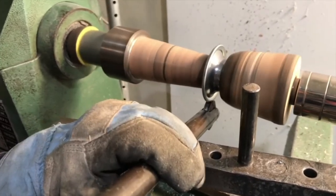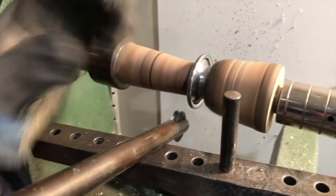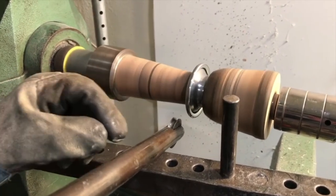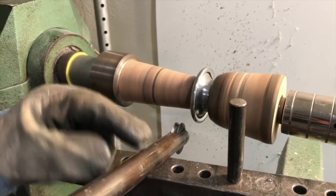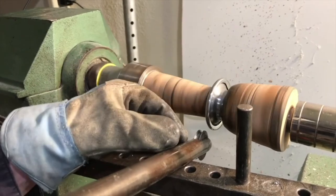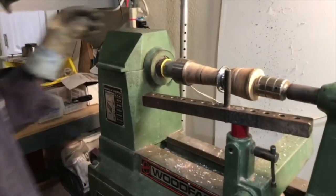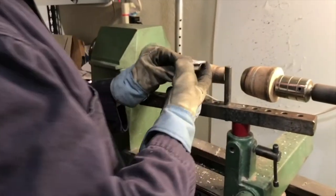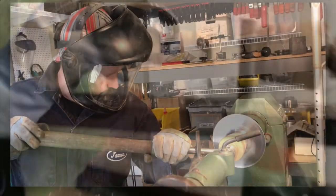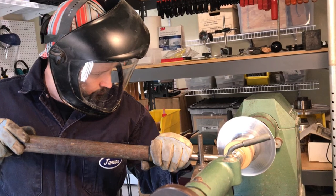Using it as a fulcrum with the wheel spinning in sync, pushing in can reduce the diameter and tighten it up, or fatten up the curvature. I use this as a refinement tool rather than the main tool for rolling edges, but everyone develops their own ways of working. This is a great way of resolving the edges of metal — for people who aren't metalworkers, a bare edge can feel sharp even if it's not, so this gives a nice finish to the piece. It's a somewhat advanced technique worth practicing, and a great design element. If you enjoyed this video, please hit the subscribe button so you can hear from me when I post future videos.